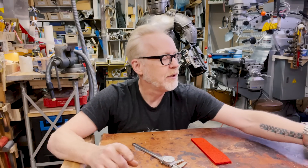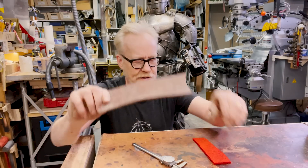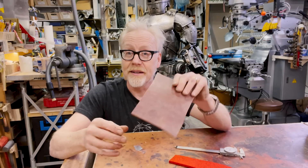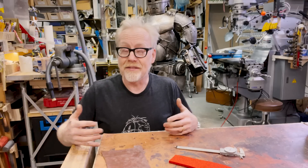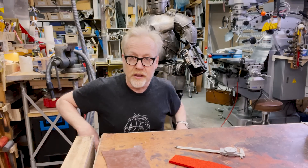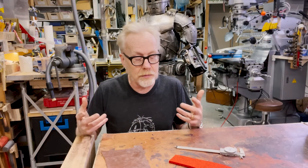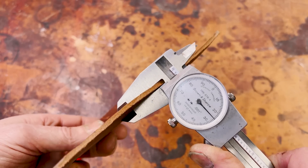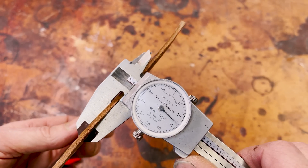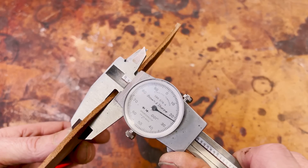I bring this up to talk about measuring a piece of plastic — you could compress it. What happens when you have to measure a piece of leather or a piece of felt? In a factory that makes something out of leather or felt, there comes a requirement for certain amounts of thickness. This is absolutely true with the aprons that we manufacture. We use the same type of leather for the pockets and for the hammer rings, but the pockets leather has to be thinner than the hammer rings because of their different requirements in terms of strength. So if I measured this piece of leather with this micrometer, you'd see a variance of about six thousandths in terms of how much pressure I can put on this — I can put it on and let it settle back, but is that going to be the right measurement?